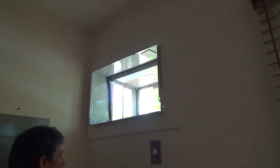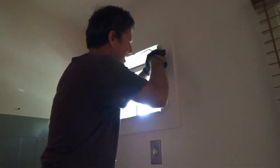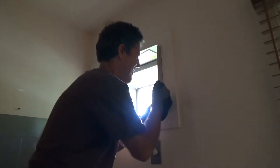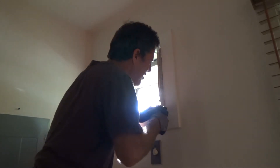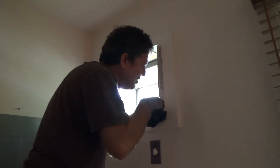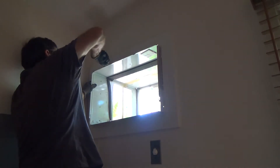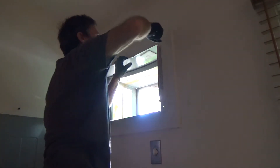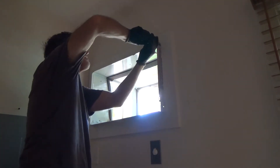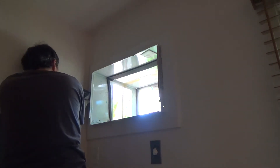Okay, so what am I going to do next? I'm going to use my sheetrock knife and score this all the way around. If I go down, I don't like to go to the bottom — I'll be careful, because then oops, right over the trim, and that's the last thing you want to do. Once I get it going I can kind of pull on this and it helps me break off some of it, depending on how thick the caulking is and how old it is.